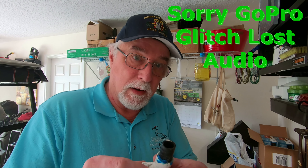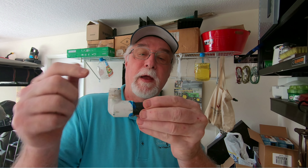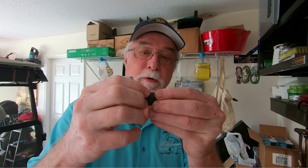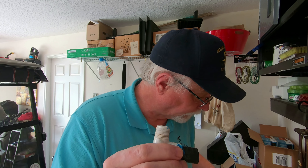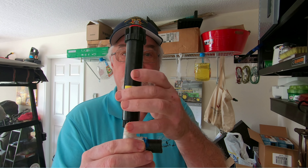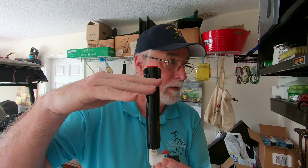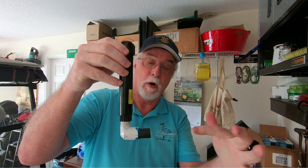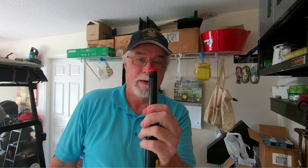These are extensions. What I'm showing you here is that's the underground pipe with a one-inch extender put into it — that's the water pipe that carries the line to the water sprinkler. The threaded part is where your sprinkler head screws down on top. The new head goes under the ground, screws onto the water line, and is buried up to a certain point — the rest is above ground. Water goes in here, the sprinkler head goes on, and with water pressure it comes up above the ground.